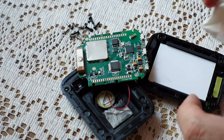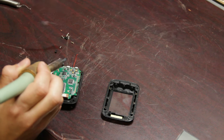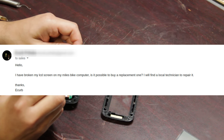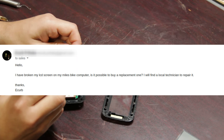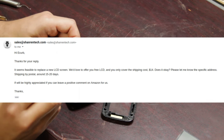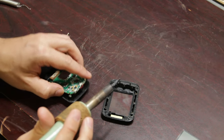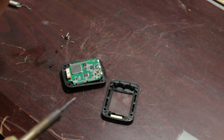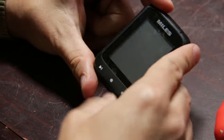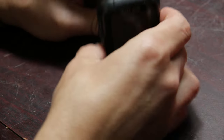After the 11th time it did break the LCD screen. Well, there's water getting inside and the screen is now broken. So I thought, okay, let me just give a test of their customer service. I contacted them with a pseudo name and a different email account and said, hey, I broke my screen - how can I get a new one if I want to fix it myself? To my delight, they were really friendly and said okay, we'll send you a new one, just pay the shipping, which was $14 to my house here in the US. It came in about a week and a half, two weeks, and I did solder it in and it did work. But unfortunately that water intrusion did screw it up - it works when you plug it in, but the battery circuit doesn't work. I think the resistor right after the battery looks like it's damaged from the corrosion. I tried cleaning it up with alcohol but it was never able to work again with the battery.